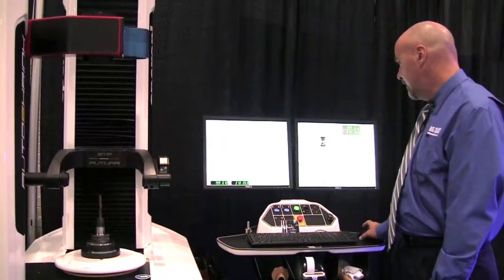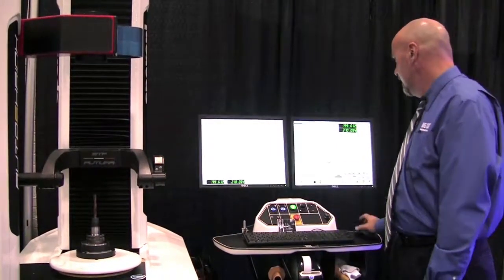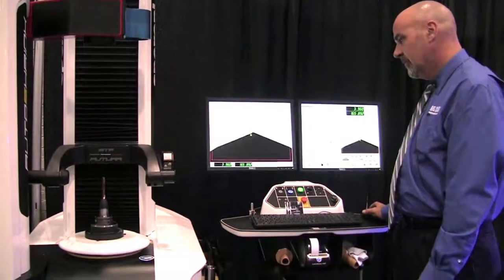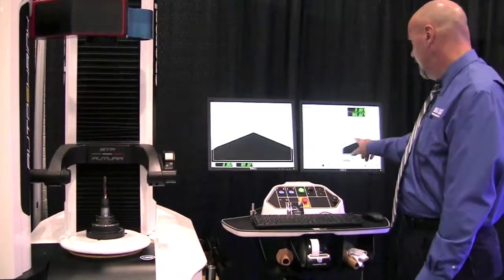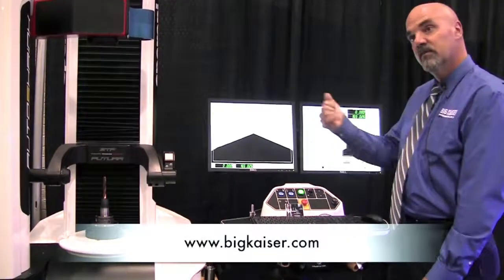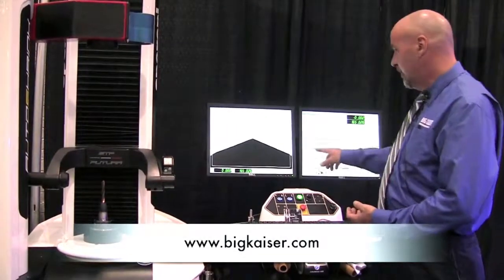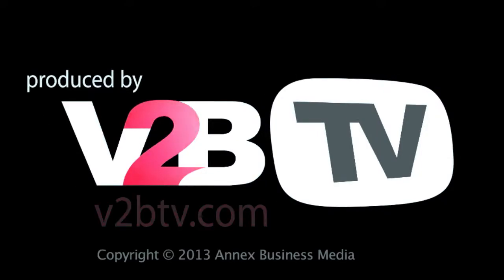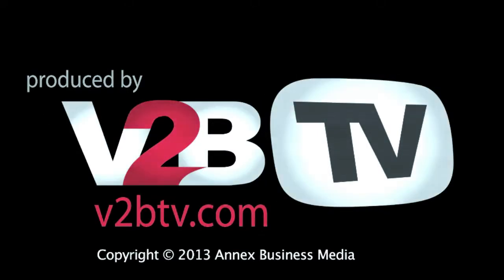Once it's complete I can go directly to my measuring. The holder comes in and my number is displayed. I can save it out to the machining center. Once it gets completely normalized, I will be less than 5 microns off from my setup.